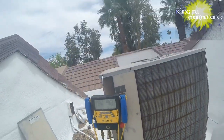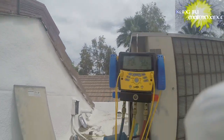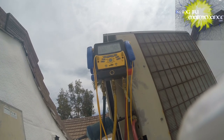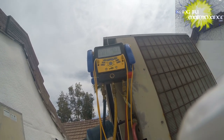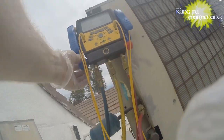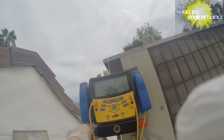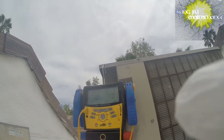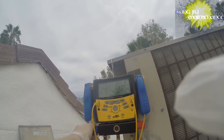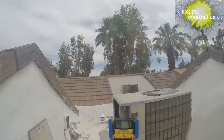Glad to have dialed this out. This one's given me a few rounds of trouble. Take a look where we're at now. So we're climbing on our virtual saturation temperature, and PSI is about 30. Now we want to be closer to 65, 69, somewhere in that range, just as a ballpark.